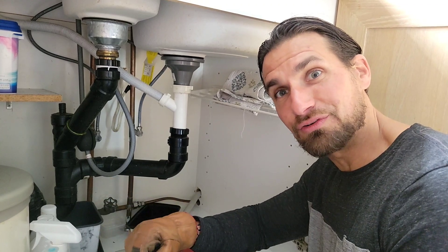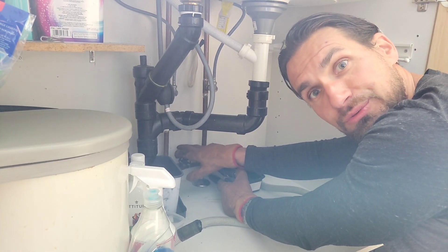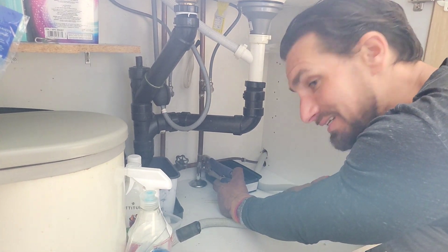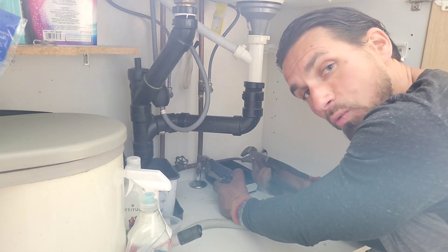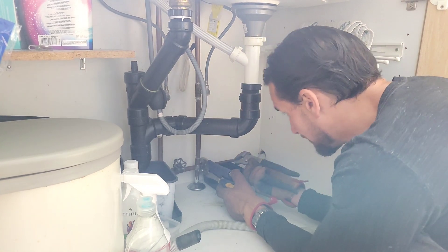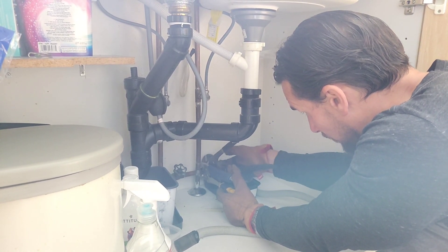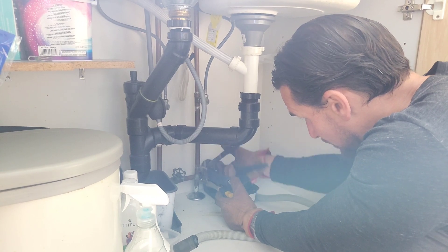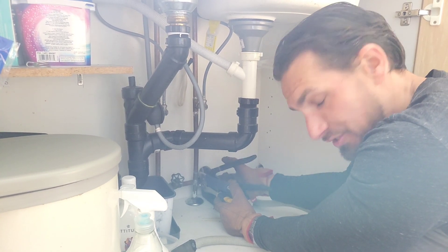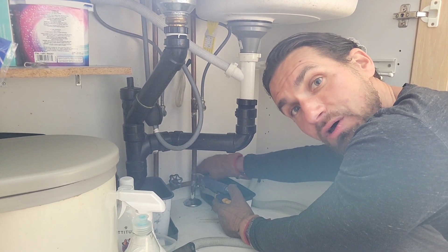Stay tuned for step three. You really want to make sure you don't have vibrations going to the rest of your copper piping, because the welds on copper piping — you shake those pipes a little and they'll come right out and you'll have a real leak, which means you'll need to turn the main valve off. To avoid vibration I'm using my vice grips: they're holding things in place and I'm making sure the vibrations stop at the clamp as I go counterclockwise.